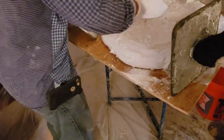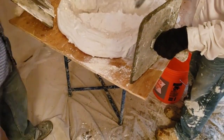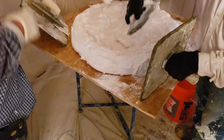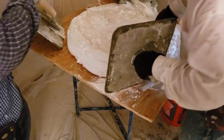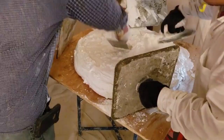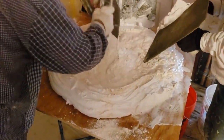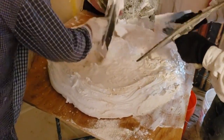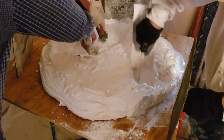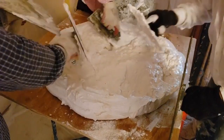We aren't doing that here — we've got a big patch, so we're just beating it up. The mortar is a little soupy; we've got to sprinkle a little more in. Mortar should be sifted in, not just dropped in clumps — you don't want clumpy, lumpy mortar. We're beating the center up first and beating the inside of the lime ring with molding plaster first, to keep the soupy mortar from running into the floor.